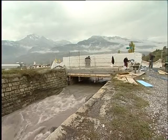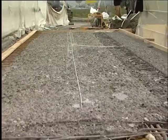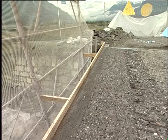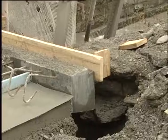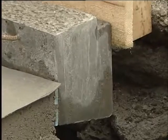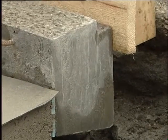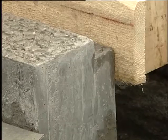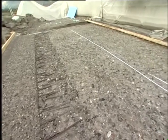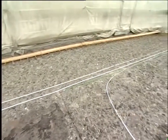The first on-site application of UHPFRC was done on October 22. The prefabricated UHPFRC kerb, together with the new reinforced concrete beam, was connected to the existing structure after removing the damaged downstream kerb. The end part of the upper surface of the new kerb was notched to improve the bond capabilities of the cast-in-place UHPFRC overlay. The upper surface of the prefabricated UHPFRC kerb was made rough by casting vertically against a rough concrete surface at the prefabrication plant. The upper surface of the bridge deck downstream was hydro-jetted to remove chloride-contaminated concrete and provide a rough surface for the application of the UHPFRC overlay.